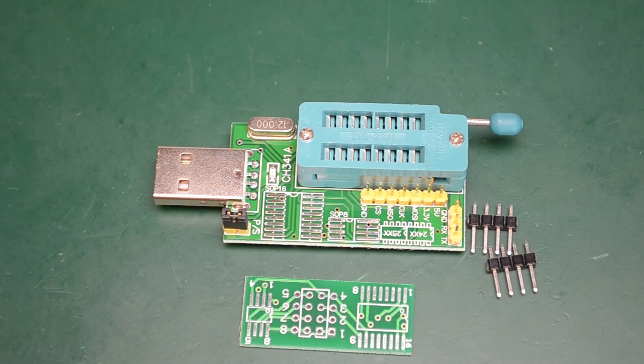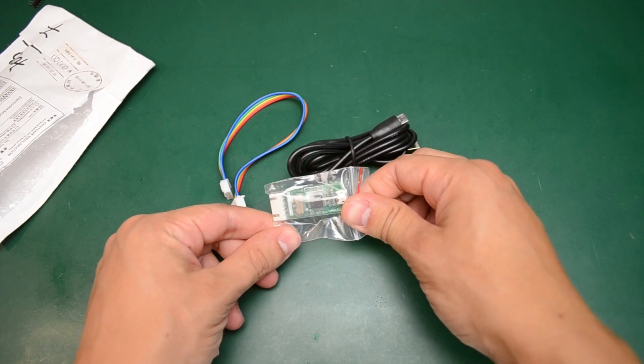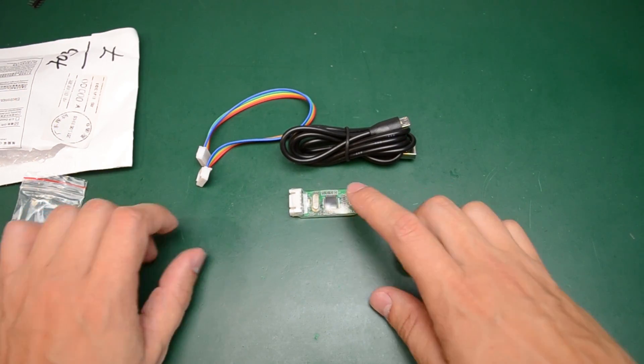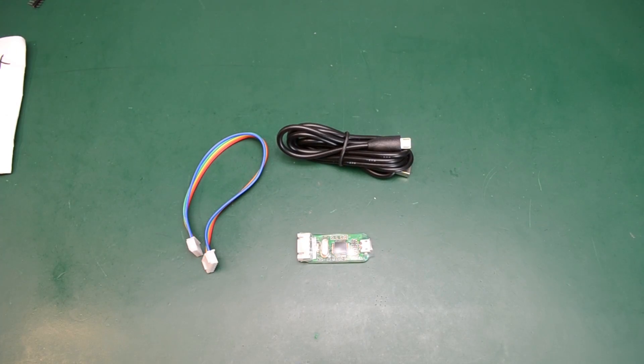We have this small module which is an SWD mini programmer/debugger for the STM32 series microcontrollers. Together with the module you get the required 5-pin JST cable and the micro USB cable for connecting to USB. Although a clone, the module is supposed to be compatible with IAR and Keil but only supports the SWD protocol, so if your chip does not support SWD this isn't going to work for you. It was $8.49 with free shipping, which kind of rivals the discovery boards in cost, but I thought I'll use this someday as a more compact standalone debugger/programmer.